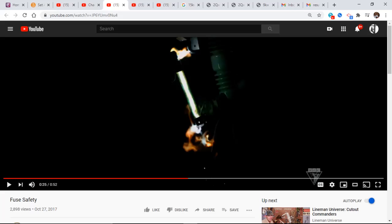Is a trencher too loud? Is a mini excavator too loud? Is a line truck running at full throttle too loud? I don't have a meter out there to measure the decibels. The good safety rule of thumb, and what you'll hear from safety directors, is if I come up to Mr. Snelling out there in the field and we're standing talking with each other, and Mr. Snelling cannot hear or understand what I'm saying, that's when you need to put hearing protection on.